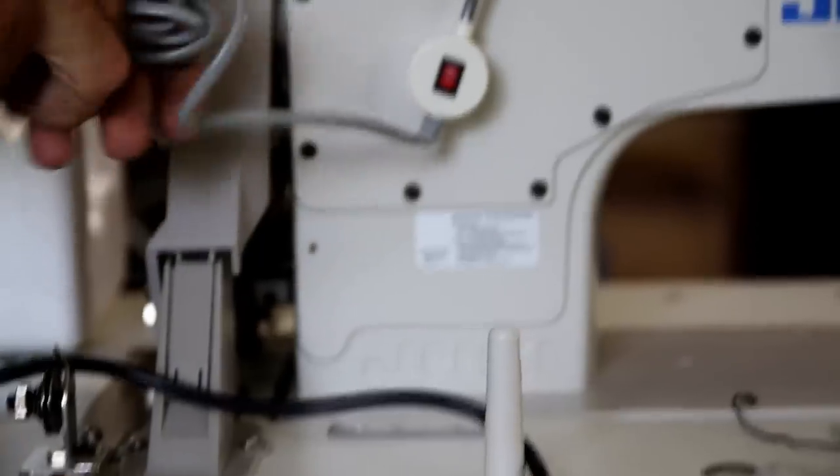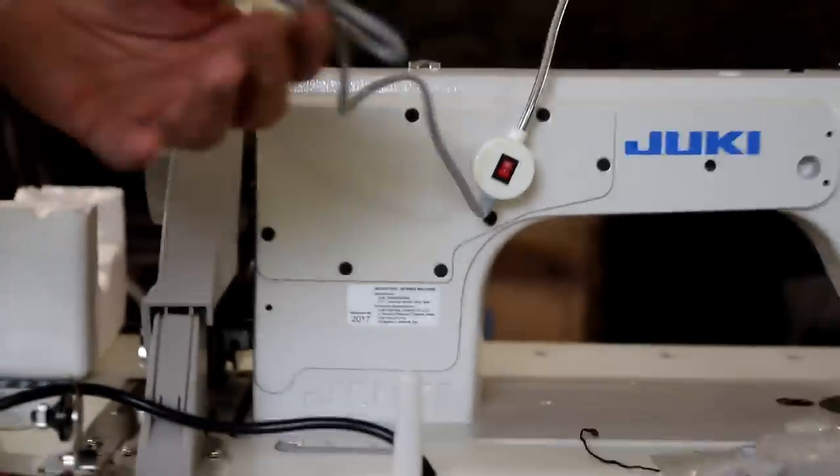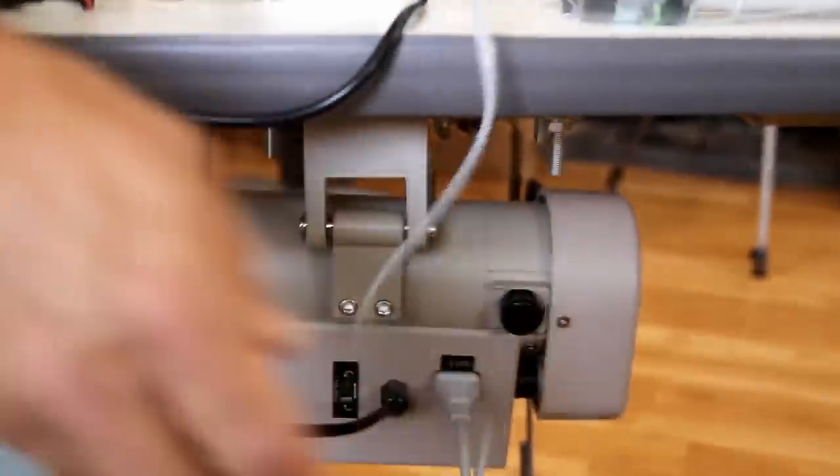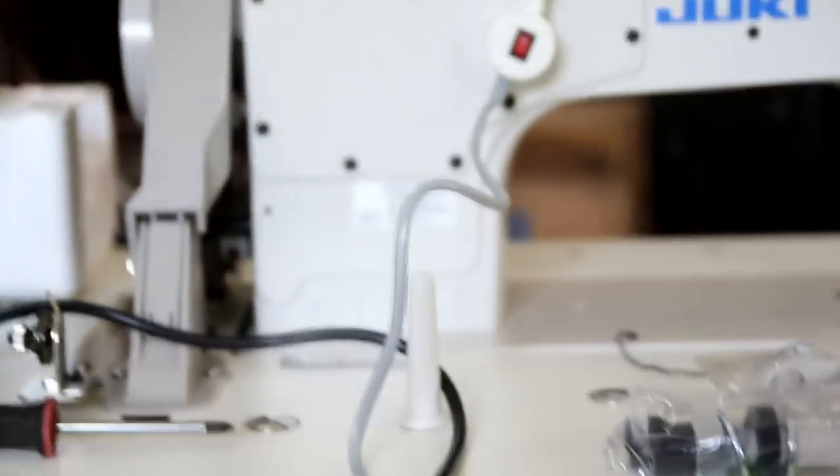That's what I'm going to put on the belt guard on the motor part on the bottom. I'm going to put it on just like that, line up the screw hole, put the screw in, and then there's one more screw on the other side. Then the lower belt guard will be on. Our LED light is magnetic — it can go anywhere on the back here where it can reach, and it simply plugs in to the back of the motor right here. So you have power to the motor, you have power to that. Light is done.